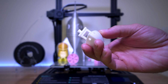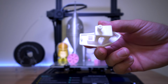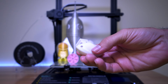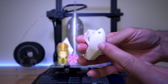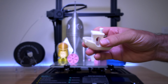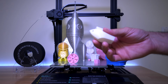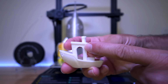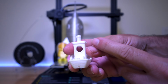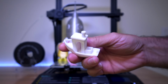So yeah, this thing definitely has the precision, and just looking at this Benchy, it reminds me a lot of the Ender 3. It's actually a little bit better than the Ender 3 as far as salmon skin and ghosting and vibrations. It's a little better on it, but it does look like it can benefit from some TL smoothers, but that has to be seen. And also the cooling is quite nice too. You can see on the arches here, there's nothing really weird or any kind of blobs. It's quite clean. So very solid for sure right off the bat.